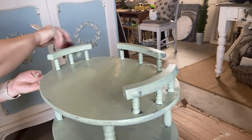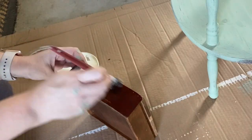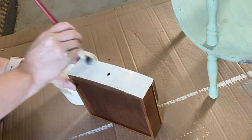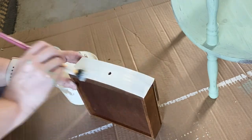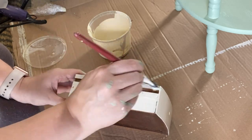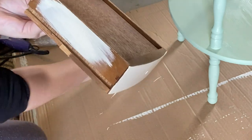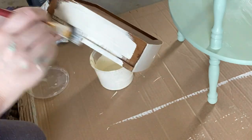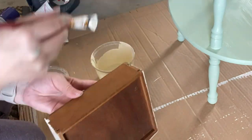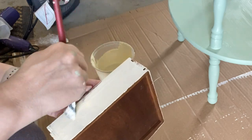When you're painting a furniture piece where you have to change directions with your brush strokes, it is definitely a good idea to go back in with a smoothing stroke to make sure that you smooth out your brush strokes. Here you can see that I'm coming in with Dixie Belle's Buttercream Chalk Mineral Paint, painting the little drawer on all sides because you can see the front and the sides. If you ever have trouble with your drawers closing after you've painted the sides, I recommend using a wax or Dixie Belle's Big Mama's Butter on the sides that are making contact — it can really help the drawer slide in smoother.